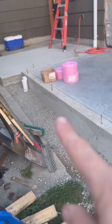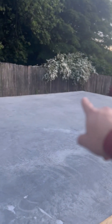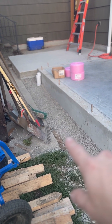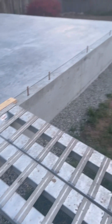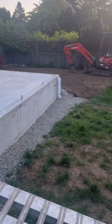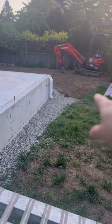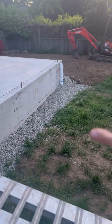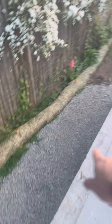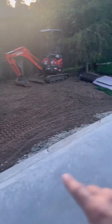Here's the slab. The major things that happened this week: we've done all the gutter routing. There's one on that corner and one on that corner. They've run vented pipe and open pipe all the way down here — kind of a french drain to relieve some pressure — and back in this now-flat dirt area there are eight-foot holes that drain into the groundwater to prevent erosion. Those dive down on the back side as well. The last couple days they brought in a ton more gravel and covered up all the piping running into those drains.